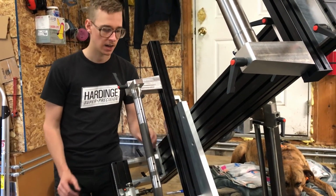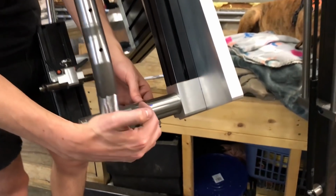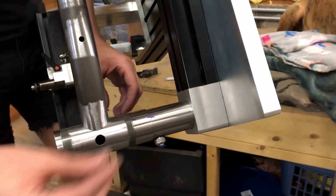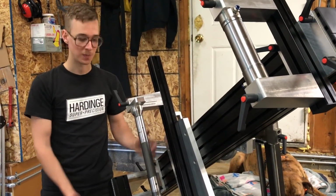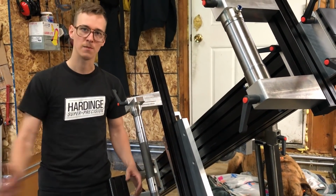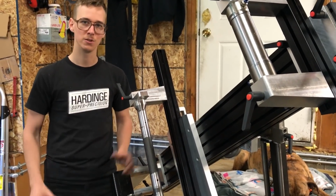Or in the past, I used to have smaller bottom bracket shells, and this standoff here had a ledge that I could push up against, and I made a spacer that was the right distance that would fit in there. And there's all different ways of doing this. You know, this is the first bike I made in like a year and a half, so it's not a big deal to spend 1 minute with calipers there. But if you're doing it over and over again, it's really nice to have positive stops that you push stuff against, load it in, tighten it, and do your work.